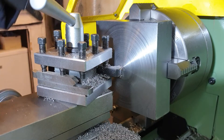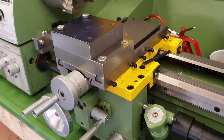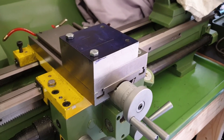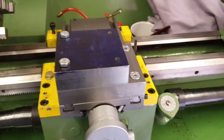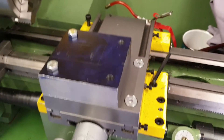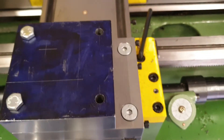We've now done that last cut across the full face. With the four bolt holes drilled through in the top plate, we can go for a little mock-up. Here you can see I've got it loosely positioned on top of the bottom plate, and the two bolts in the front or left side — the headstock end — actually pass right through the lower plate into the T-nuts in the bottom. A bit of a change of design on the fly; I thought that would be a better solution, hopefully giving it a bit more rigidity. What I now need to do is drill and tap the corresponding holes in the bottom plate for the rear two bolts on the top plate.